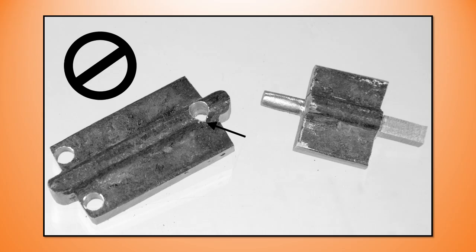Firstly, let's look at the things that didn't work with my pin collar. And with my thin bead here, having a centered tenon isn't going to work. You can see here that the centered tenon, the mortise for the centered tenon, has blown out the edge of the bead and it's just not going to finish well. So I'm obliged to do 2 tenons on the back strap material.